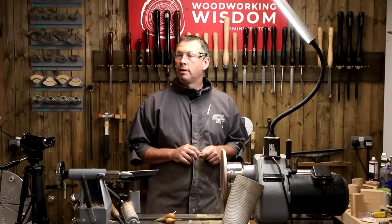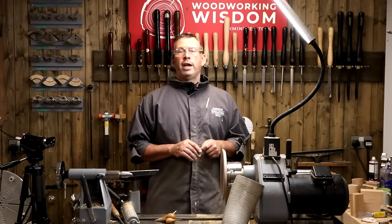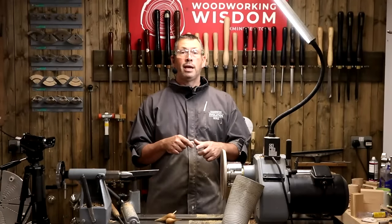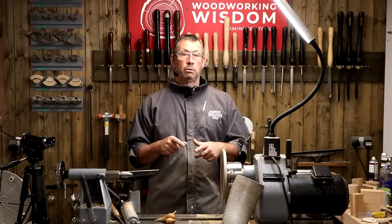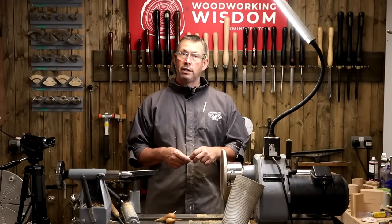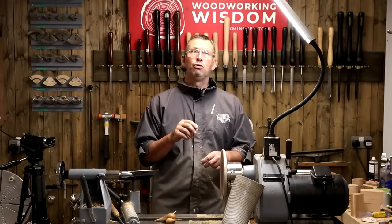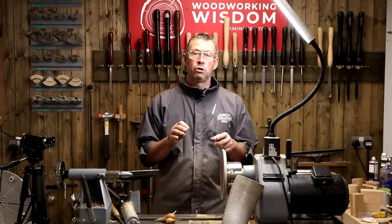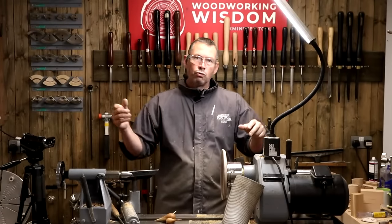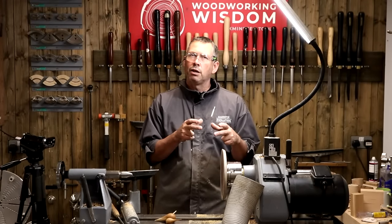Should he turn them as a solid blank and then leave to dry? So if they're limbs that you're keeping the pith in and turning them into your pepper grinders, you would need to turn them wet. I'm only suggesting this. I think if you drill them out now, so don't turn them even, just drill the blanks out. Maybe just turn them to a cylinder. That's it, nothing else. Drill the middle out and leave to dry. You might get away with it not shrinking and cracking.